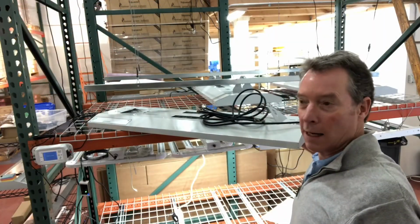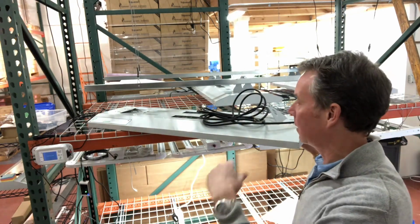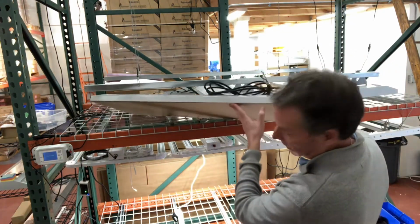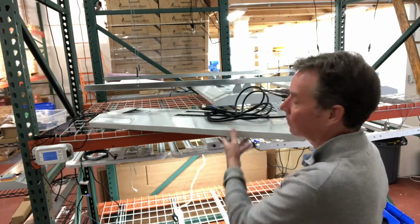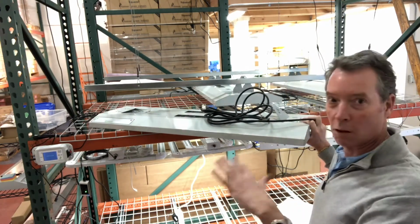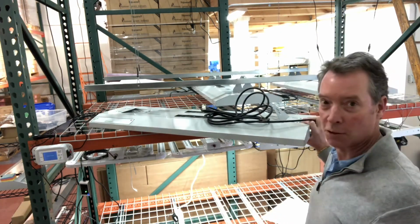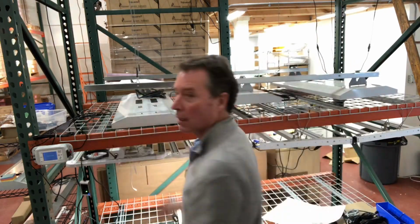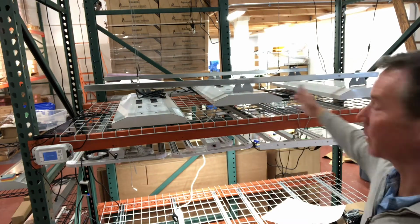Okay, so we've moved out to the demo grow area that we're putting together, and I just wanted to mention, when you're moving the Lightpanel 500 around, I recommend you keep that cardboard cover on the diodes just so you can put your hand underneath and move it. There is a conformal coating on the diodes now, which is waterproof, so a little overspray won't hurt the light, but you definitely don't want to be hitting the diodes with anything as you're moving it around in your racks.